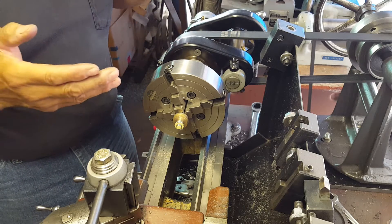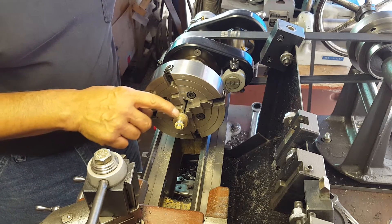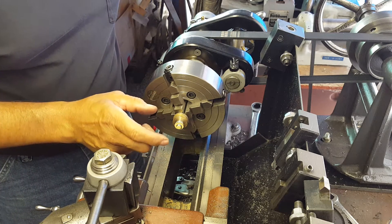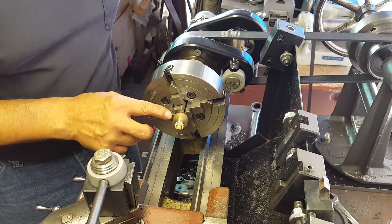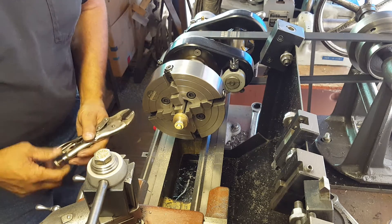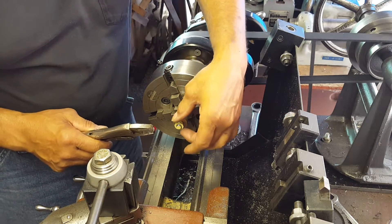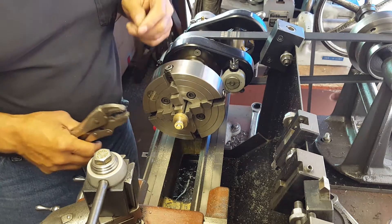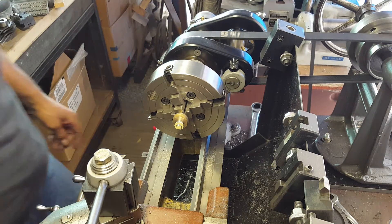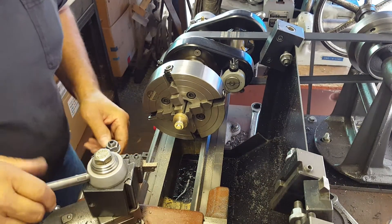Given the circumstances and my lack of tooling — if I had expanding mandrels, I think is what Adam refers to them, I could use those. But I don't have them and I want to try to get this done. The nuts are screwed up anyway, so maybe I can make another pair and put some flats on it so I can use wrenches. For right now, the old trusty vice grips — I think this is gonna work, so we're just gonna give it the old college try.